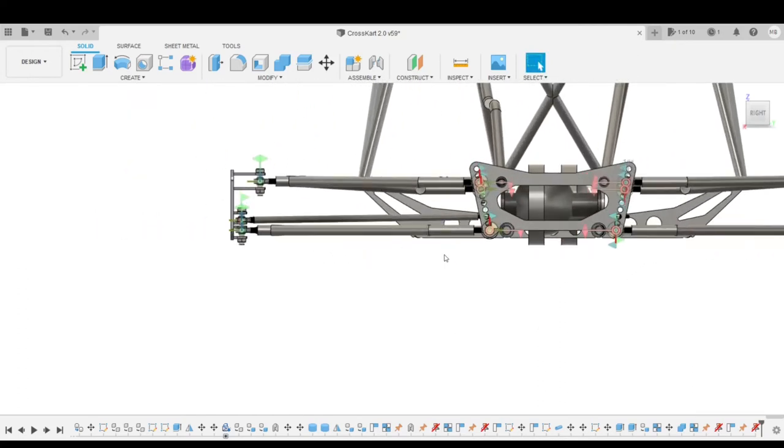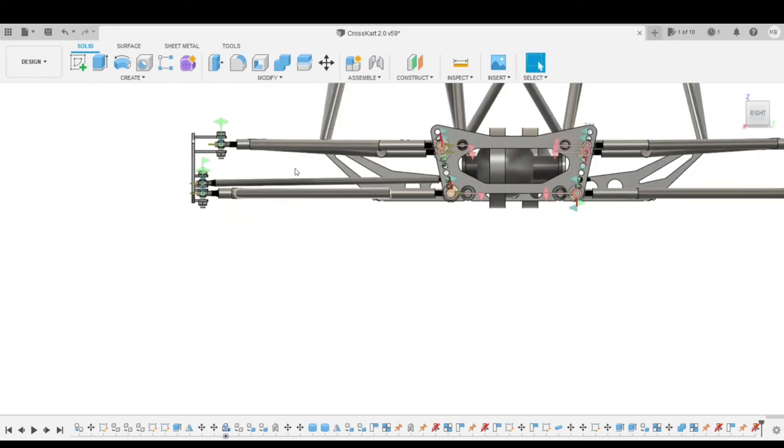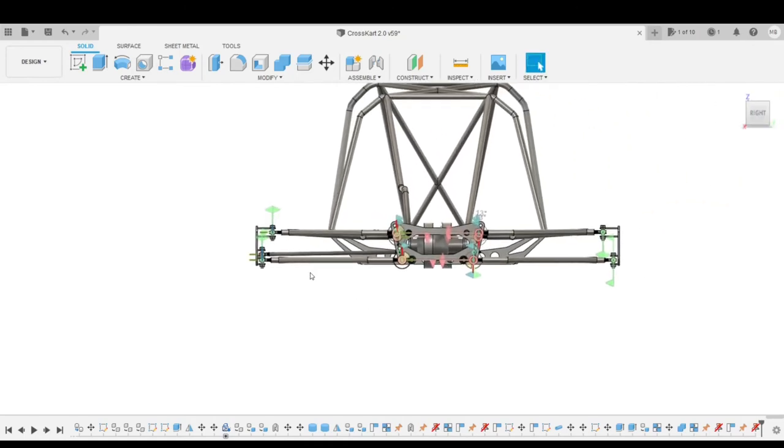And as you can see at the moment, it doesn't, because this is completely flat. This one goes down a little bit, since we need to go through those two ball joints. We need to make the median between that and go through that. It's probably going to be somewhere around this axis, since this is straight and this is pointed down a little bit. So you can see how, if I raise that a little bit, then that will get back in line with the whole system. Obviously, this is at pretty high compression, being that it's flat with the frame.